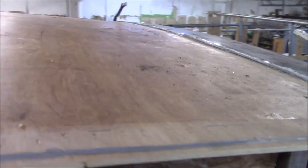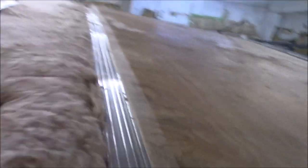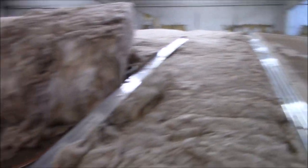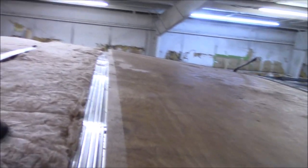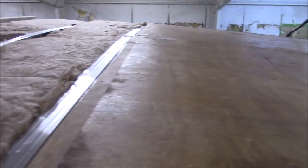Everybody asks me which one's the best. I'll spend the extra money to get a good one. This is a Mobile Suite — all these trusses, really? None of it's glued. The piece of decking came in here with sporadic screws — there's one here and about another 20 inches or so, a couple up in there, and that's it. No glue on it either. It needs to be glued. That's what's going to absorb the shock, the vibration, the twist, rack, and flex. If it doesn't, it'll strip the screws.